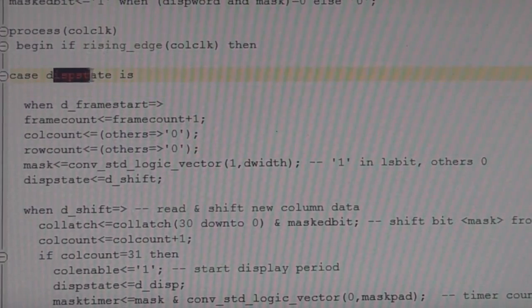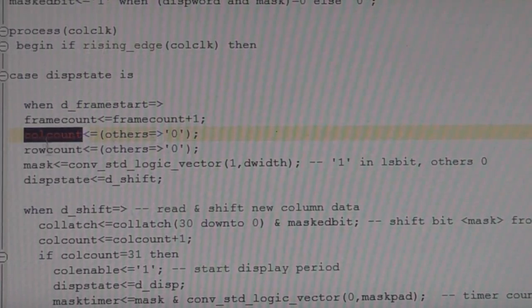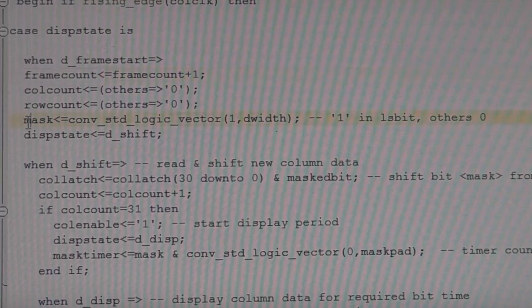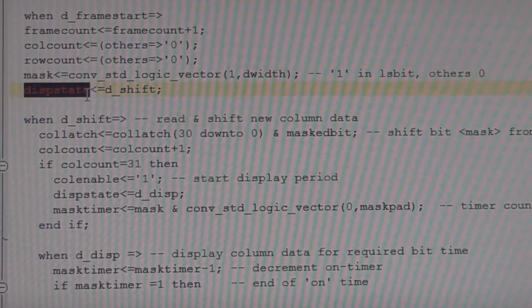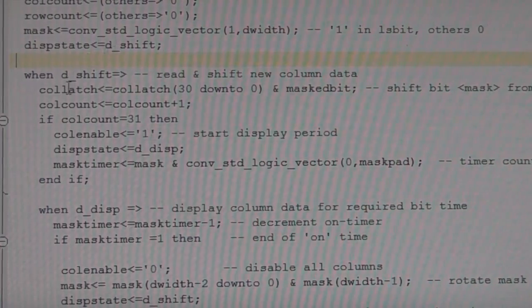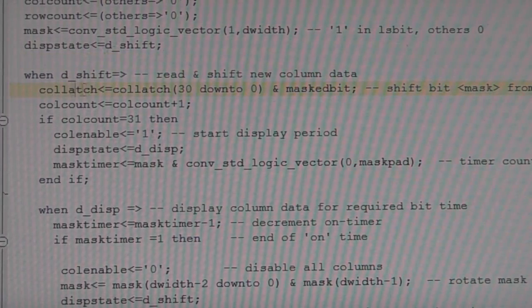So this is just a 2-bit value, and these are simply constants. When our multiplexer select is equal to this value, then the input to this latch, for example, is zero. The input to this latch is an adder, taking the previous value and one. The input, again, is a constant, and the latch bits corresponding to our state are, again, this constant value. In this state, again, we can consider this just another input to our big multiplexer. Output bits corresponding to this value are basically the shifted version of the output with this new bit in it.